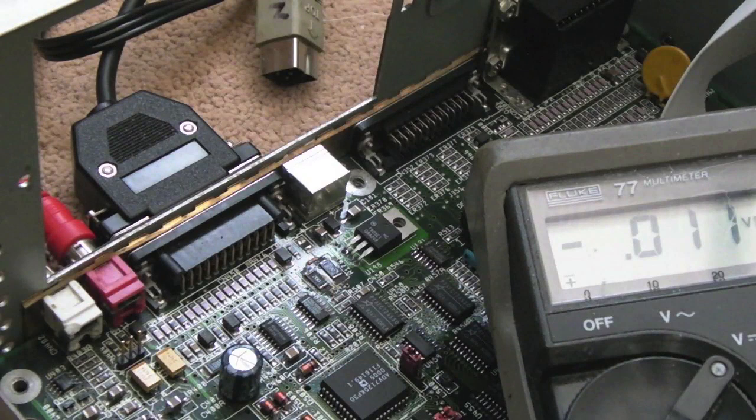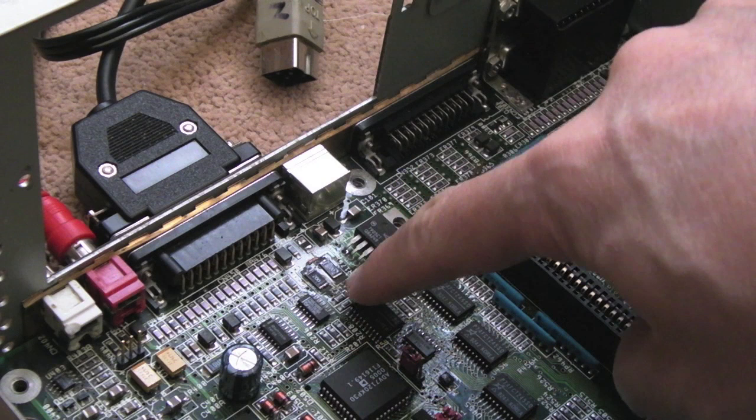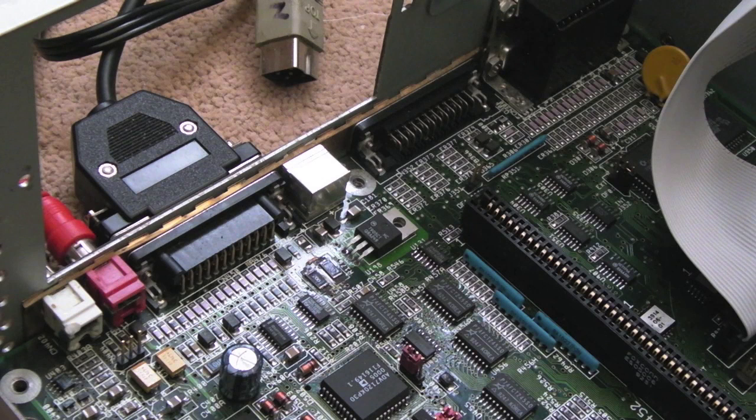So there are a number of things going on around there, but the very fact that these two wires don't seem to lead to these as I would have thought, I mean, I can't see the PCB, it looks like the traces are gone. I suspect we need a little wire from each of those to those resistors. I'm going to just look at the schematics just to double check that, but that might be the answer.